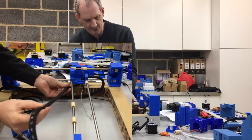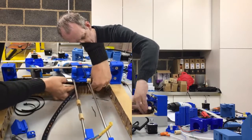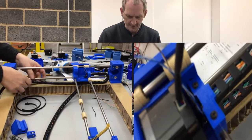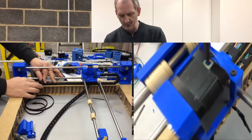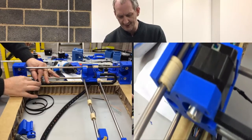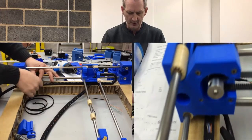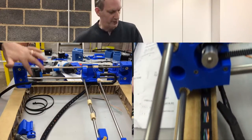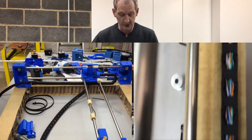That's going to come through onto that, passing on the knee. What I need to do now is get that nicely lined up and bring this part of the energy chain all the way down to the end so it's touching the actual X rod holder. I've already got two holes drilled ready — just two self-tapping screws to hold that into position.